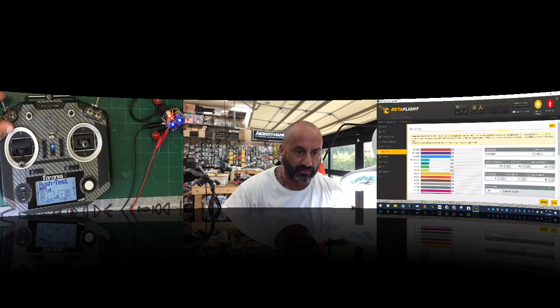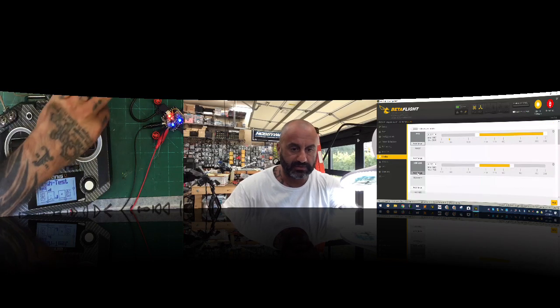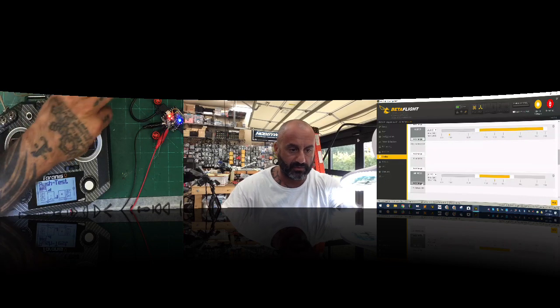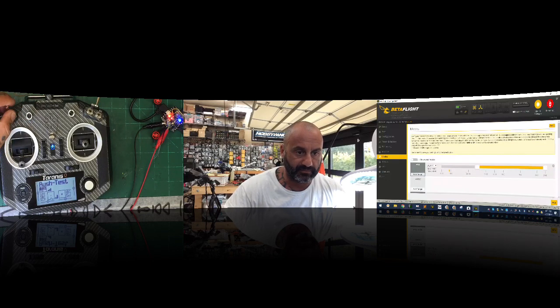We've also got our throttle set on here. So now if I go to modes, I'm going to add my range. There we go. So that's our arming. And then for horizon mode, move that on over here. Fail safe mode, put that here, and then buzzer, leave that here, and then let's see what else, air mode, leave on. That there, mode on. And acro mode, I think that's on. That's going to be it. So that should take care of it.